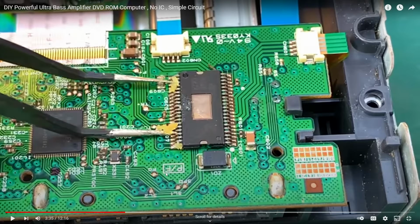I thought, well, maybe it's possible that they still had some sort of analog audio, a digital to analog audio converter in newer CD drives, even though they don't have an analog out, because the older CD drives have an analog audio out. So sometimes they still use the same old chips for things. So it's possible there is some sort of analog audio circuitry involved here, but it doesn't look like he's tapping into that in any way, especially not through the motor controller. That's just bizarre. He's not soldering that onto anything that should involve an audio signal.